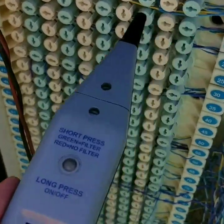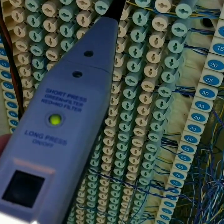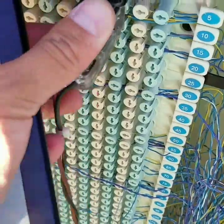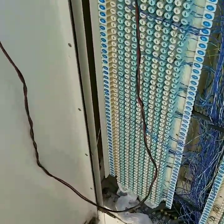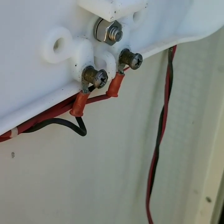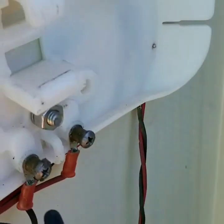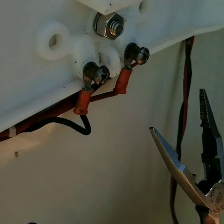I hear it on 4, and I hear it on 7. My first pair is on the alternating tone, and the second pair is on the solid tone. With the alternating tone, you can short it to verify — all you have to do is put the tone on the test leads and touch. A switch tone means it's a clean short — that's us, verified for certain. Coming back over to binding post 7 — that's us as well. Normally with the solid tone, it just stays quiet when you short it. It went away, then came back — so that's us.